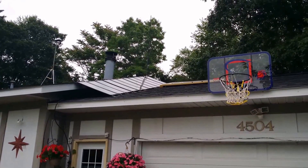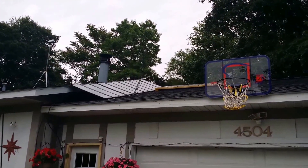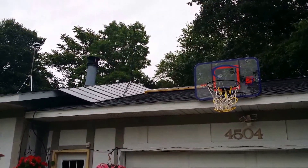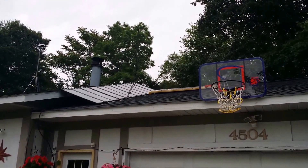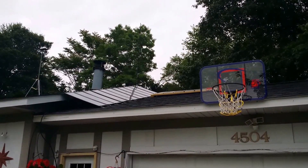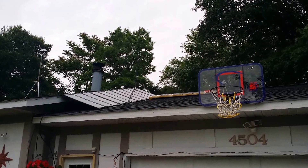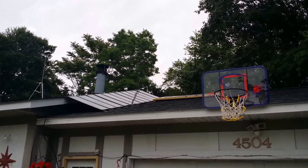Right now all these panels match the four original panels that I had, so now on the roof I've got another few panels — six panels on the boards there on the right-hand side — so 265 watts of solar now. For a good chunk of the day it's about 11.5 amps going into the battery. For the price I found them at, I couldn't pass them up. And who says down the road I don't get any of the bigger panels and use these for something else.